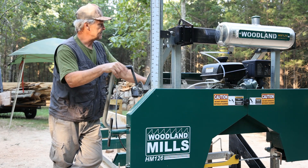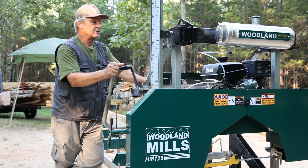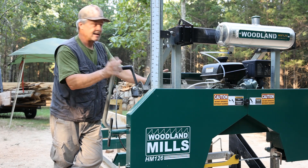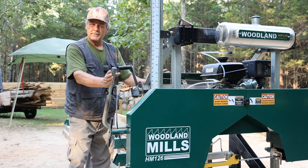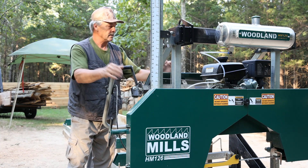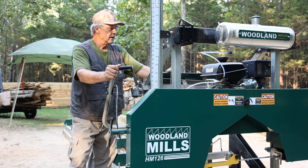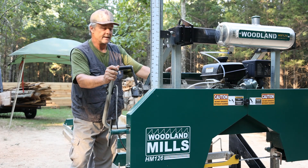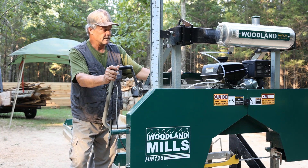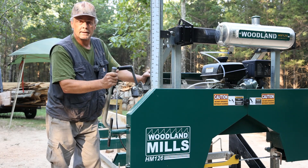Out of our milling process, the hickory that we brought in for our ridge pole as well as our last tie logs was the toughest material to get through, simply because of the sap and the fiber of the wood itself — it would actually clog the saw blade up. I didn't have to sharpen a couple of them; I simply had to take them up and remove the tree sap as well as the fibers off of the teeth so the blade could continue to cut.